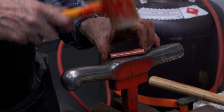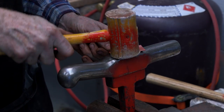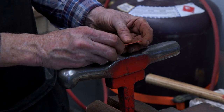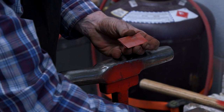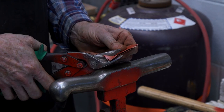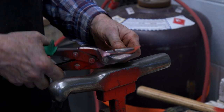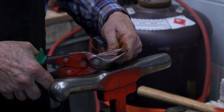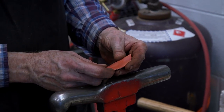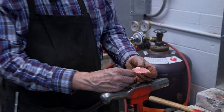I'm simply going to flatten the fold over. This is called a basic line fold and we can do all kinds of things with it, but right now we're just going to make a leaf. I'm cutting it with a pair of aviation snips. Aviation snips are useful because they multiply the strength of your hand with all these lever parts on it. I've cut a half-round shape and at this point I'm going to walk over to the rolling mill and use the wire part of the rolling mill.